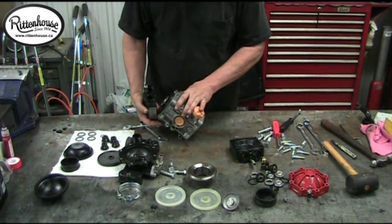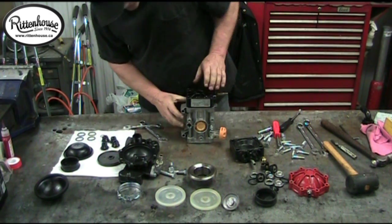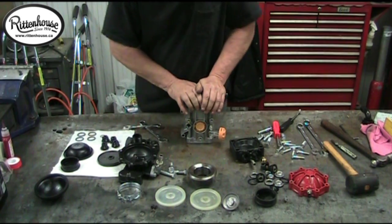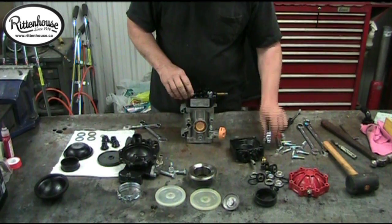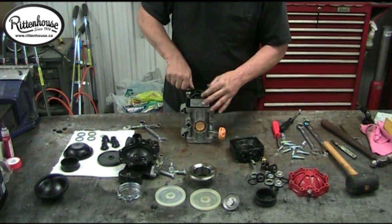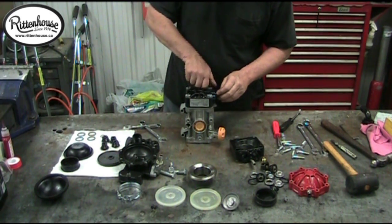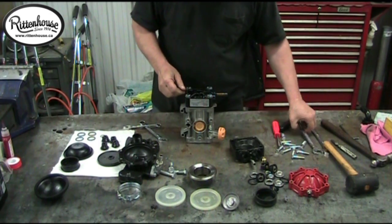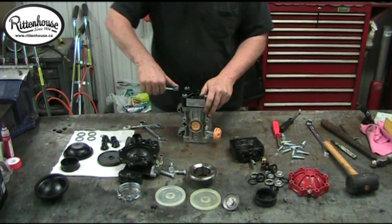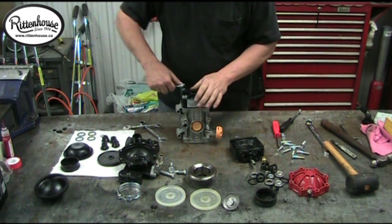Take a look at your head and make sure that you're putting it on the right side. Just work it back and forth a little bit, make sure the other groove is in — you'll know it's in when the space between the head and the body looks like they're actually pretty close. Then take your four bolts and put them back in. If you're lucky enough to have an impact wrench you can use that, but if you're doing it by hand, turn them all in by hand first, then take your wrench and go diagonally — tighten them down as if you were tightening the wheel of a car. You need a pattern so you can pull it down evenly and don't have any excess pull on one side.